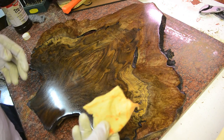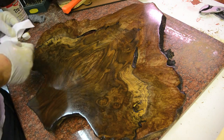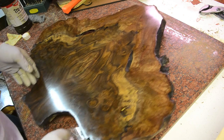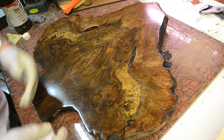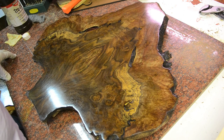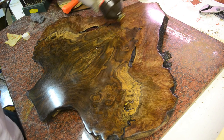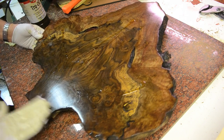Now we're going to do our fourth coat. Make sure you're always using a new little cloth each time you do this, because they get really hard after you let them sit for a while. This is the fourth coat — I've got an incredible sheen on the piece of wood now. I'm going to do one last coat because I've got a couple little spots down here that need some more TrueOil. I'll let it sit for a couple of days and then take it to the buffer. When you go really high in sanding grit you have less work to do on the piece of wood. I'm going to put just a little bit less this time on the piece of wood and just rub it in.